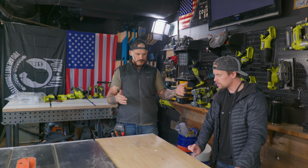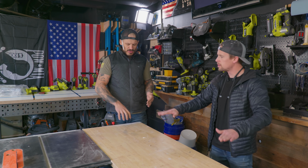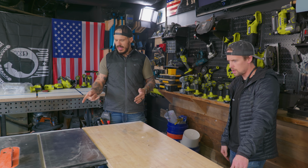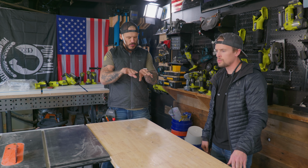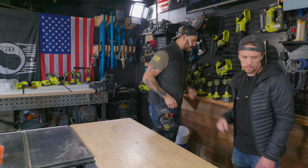What do you think about cutting the radius of those 2x4s off, and then when we do our panel glue up, we won't have near as much flattening? Yeah, let's do it. Let's rip it off on the table saw, and then that will be nice and clean. There's no grooves inside of it with dirt and dust and crumbs to get into. Yeah. Let's do it. Boom.